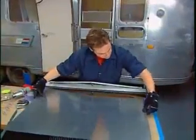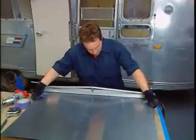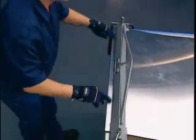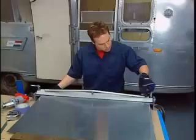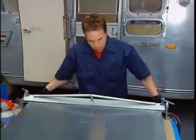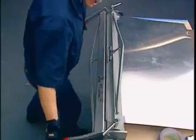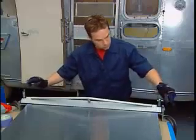The way we'll do this is just to loosen our jaw, and we insert our countertop into the back side of the jaw. Now on the front side, with the mark that I've made, I'm just lining it up with my thumbs to the edge of the upper jaw, where we can make a successful bend. Then it's just a simple matter of clamping it down. Now we create a 90-degree bend. You want to move slowly and back off to see where your bend sits. You can't over-bend it — we want a true 90-degree angle. We then relax the jaw and feed it out the front side.